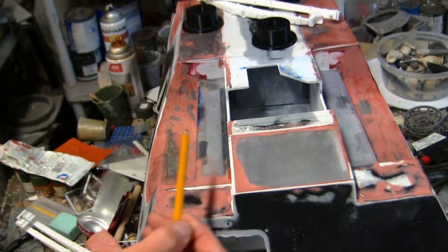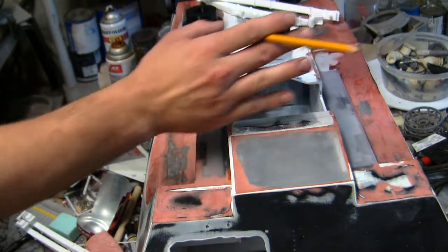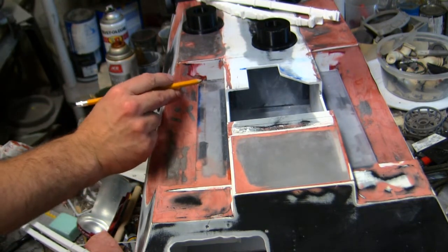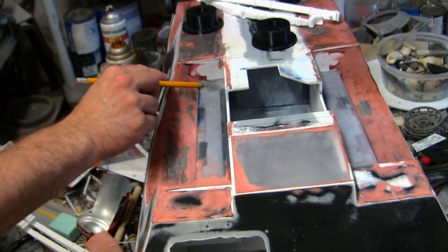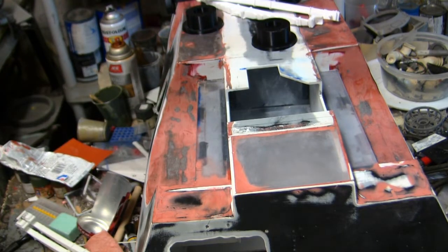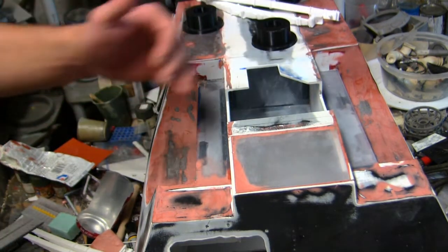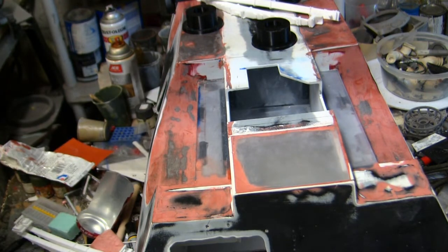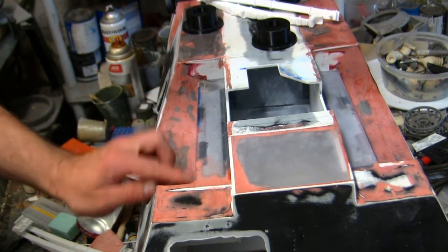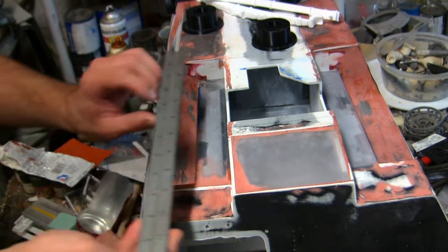Now, when it comes to the lateral alignment, you want to keep it as symmetrical as possible in order to prevent any sort of issues with the mounting of the rear differential. One thing I noticed is that on the model, I used some Plastruct ABS angle for supports on both of these sections during their fabrication. They are nice, squared and even, so this gives me a fantastic reference point to point out where these parts need to be fitted. After looking at the model as well as the real one for reference, it seems that the pieces are slightly past the edge here on the mounting surface, so this makes for a perfect location to square it off.